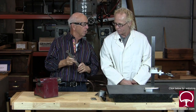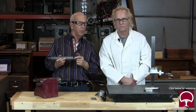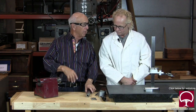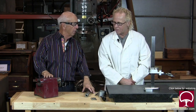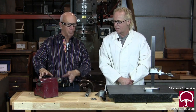So we're going to turn it on a lathe, do all that stuff, do the thread, do the tricky part here — which is this number two Brown and Sharp taper — and we're going to grind it, slip fit it in here. Then the episode after that we're going to start assembling everything and show you how it works.